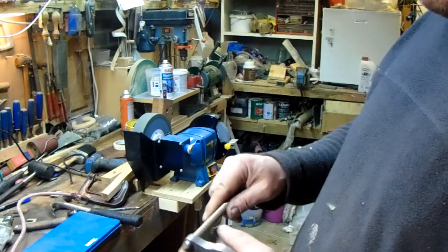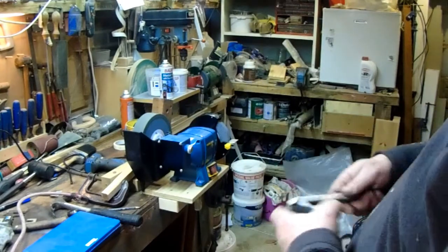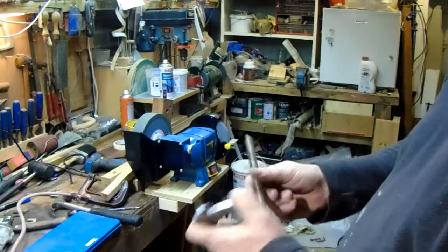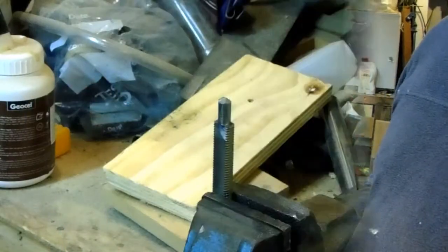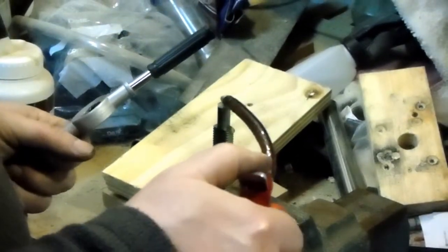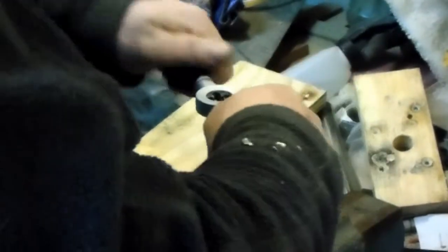You just want to put a thread on that end, so enough just to hold that. Hopefully it should be alright. It'll actually go. It'll sit that way actually. I'm just going to thread that M10. Right, that was, got those two chamfers on either side of that, and it ain't going to tap with them on there, so I've ground it to kind of like a point. We'll see how it goes now.